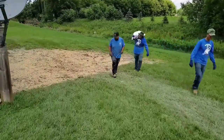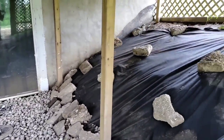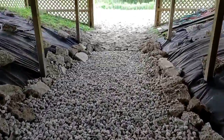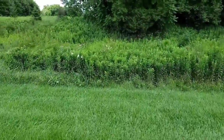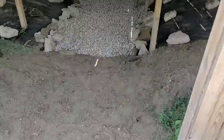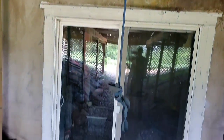Let me talk you through the complete project. We just got done grading — we took all 15 yards of dirt that we dug out and built a protective berm. The guys put strong grass seed down. We've got our duplex system and the heater — that's a duplex system built for the north. We repurposed the 15 yards of dirt from underneath the deck and built this nice soft berm to keep out the river during flood events. That river can no longer back up into this walkout basement. There's a beautiful cobblestone walk into the basement. It's a perfect demonstration on how to use a chambered sump pump system to increase your on-site storage and maximize the life cycles in your sump pump.